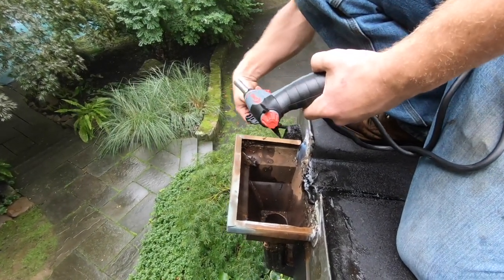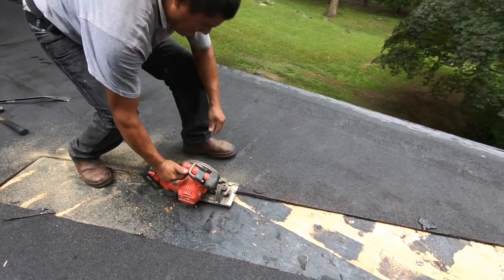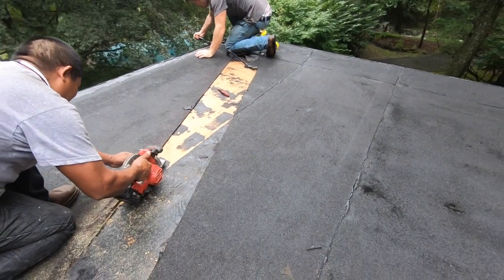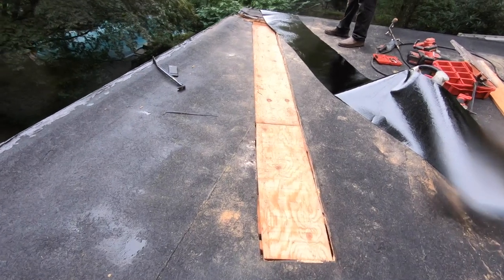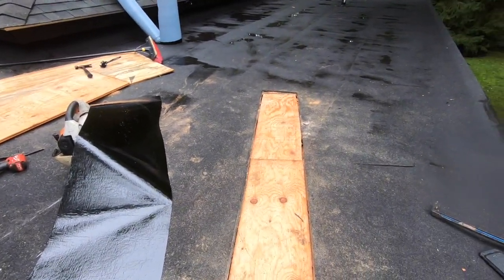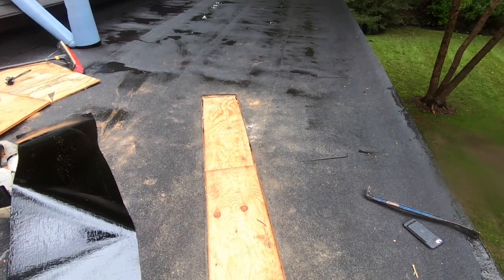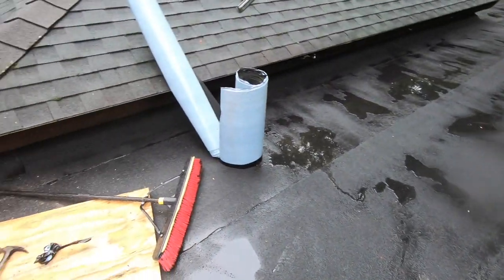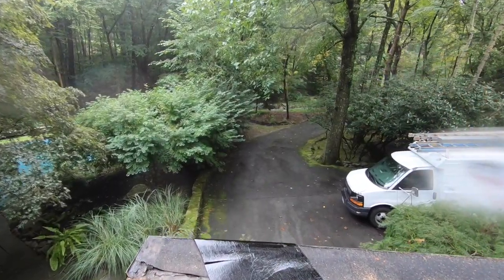He's taking the leader header off quickly so I can lower it. We're expecting rain this afternoon, so I've got about a three-hour window to do this channel to get the water off the roof. I lowered the scupper on this end and got the plywood in. This is the most difficult channel to make — when you go at the angle across the beams and rafters, it's very hard, almost a carpenter's job. But I did it. We got from the low point all the way there. Now we're going to line it out and torch this because rain is forecast in the next hour.